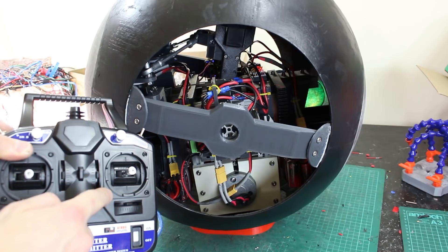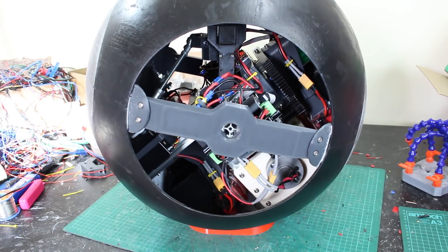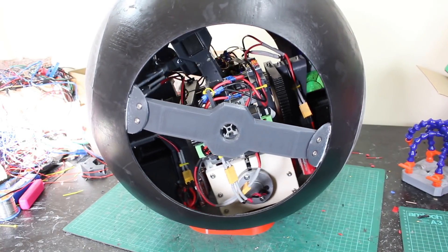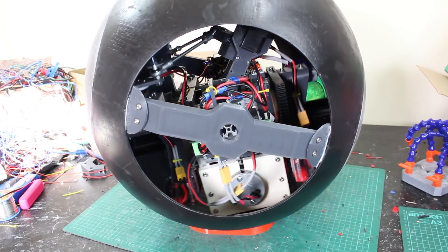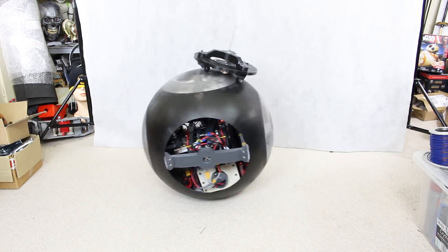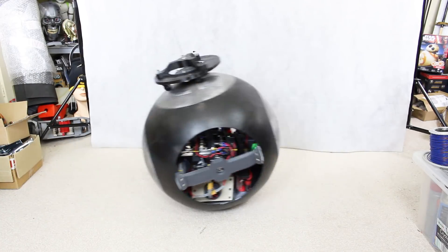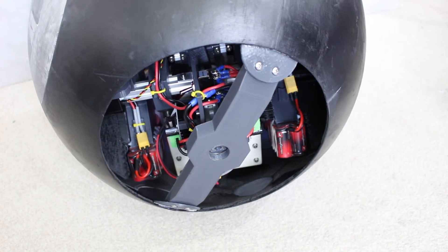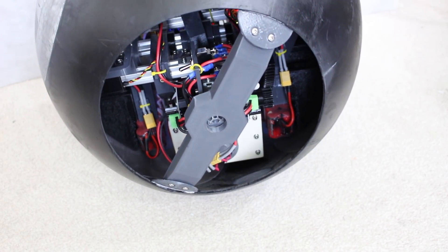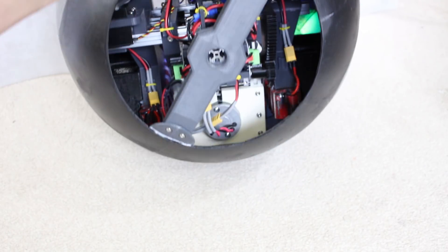The main drive for the robot is driven by the other stick on the transmitter, and that's actually trying to set an angle measured by the inertial measurement unit. So if I push this forwards and backwards, it tries to hold an angle that I set, and the head stick follows it as well, using the IMU to push the head in the direction I'm driving. When it's on its base, pushing the stick causes it to roll along, adjusting motor speed 50 times a second to hold that angle for a uniform drive. The head stick moves in the direction I'm traveling. I can also lean to steer by moving the side-to-side axis, which has the batteries on, along with some packs of lead for extra mass. It's also dynamically stable — if I manually lean the robot, it tracks and keeps it stable, stopping it picking up a side-to-side wobble.